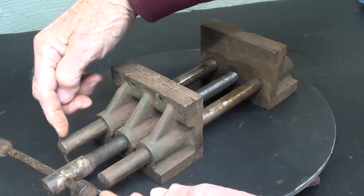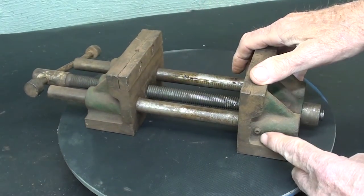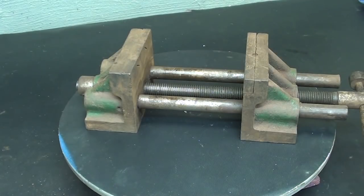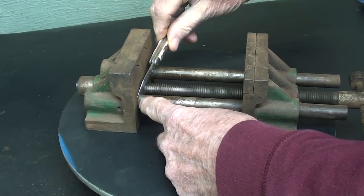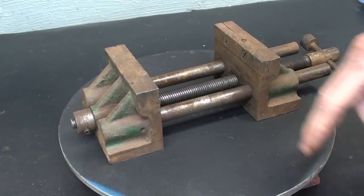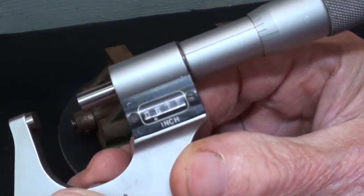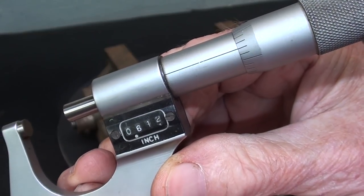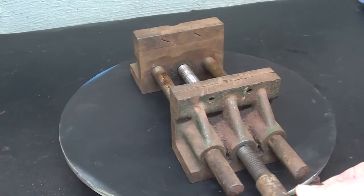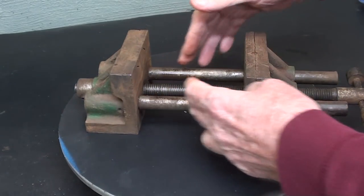It will open over 6 inches. Someone has beat the daylights out of it, and the guide rods are greatly mushroomed at the end. The guide rods are held in by set screws, and I discovered that these 5/8 guide rods are stepped down, probably to a half inch, where they enter the casting — and those holes are blind holes. The guide rods are 5/8, but the screw diameter is slightly smaller: 0.612 instead of 0.625. I'm not sure why it's undersized, but these holes line up very well, which is a difficult thing for anyone to do.